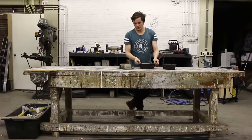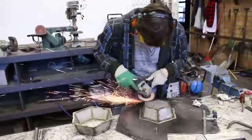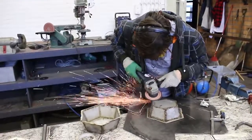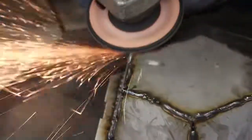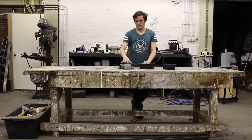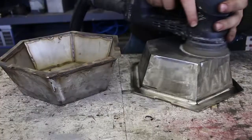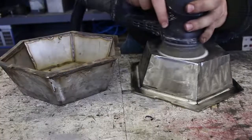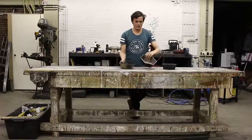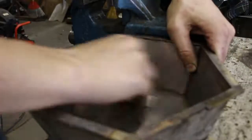After welding the bowls, make sure to make the edges as smooth as possible. This will make it easier to release the bowl from the mold. Especially the inner bowl should be really smooth. So after grinding, I use sandpaper to sand it down first and then to polish it. Especially the inner part should be as smooth as possible so it's easy to take it out. This bowl is a bit more difficult to sand, so I used some sandpaper and did it by hand.